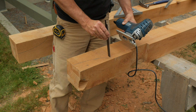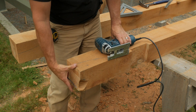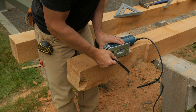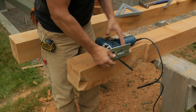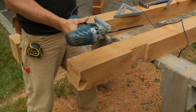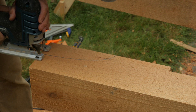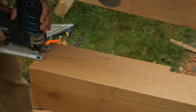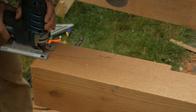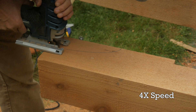See how far we can get into the corner — we may have to come back the other direction. I've marked it on both sides so we're going to try to cut a full 6-inch thick beam for this end profile. I decided to start from the end and work my way in and try to keep to the line as best I could. I like the barrel grip design as it allows my hand to be lower and closer to the workpiece. It feels more stable and natural to me and I think gives me better control and accuracy.